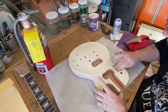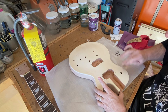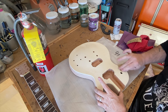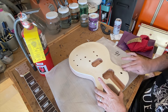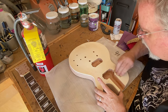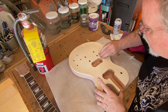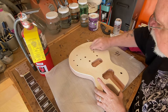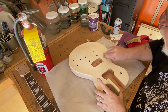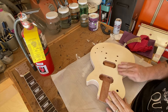When I get to the maple front, I'll only use 400 grit sandpaper. The face is a thin veneer, and I have heard a ton of horror stories about guys sanding through the top, and honestly, I was super paranoid about that happening to me. Light sanding, 400 grit only, for this kid, that's the way. Take some time while doing the sanding to look for residual glue. Glue will really bite you in the rear end when it comes to applying the finish.